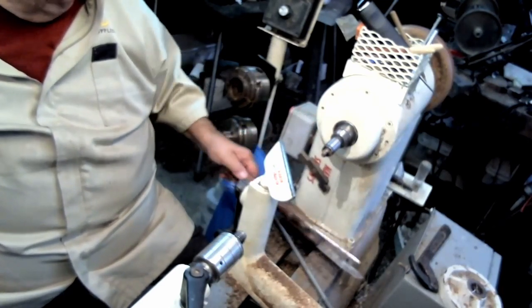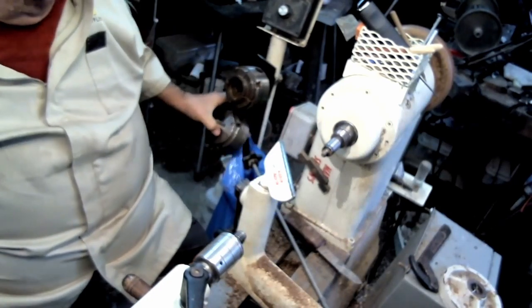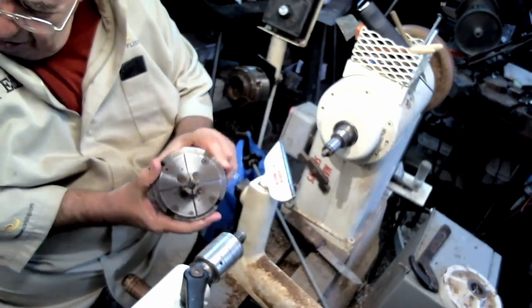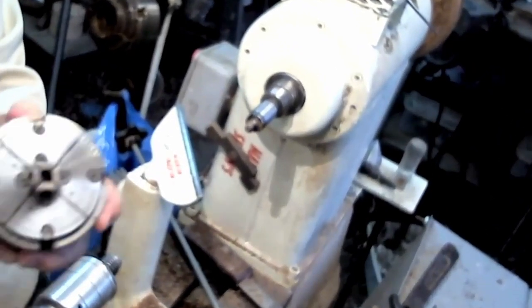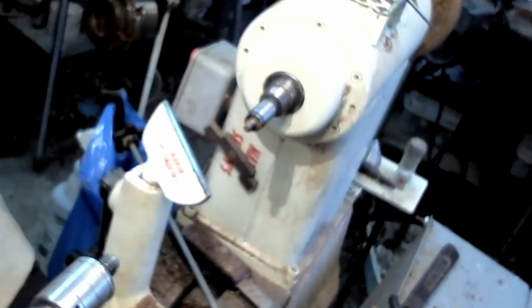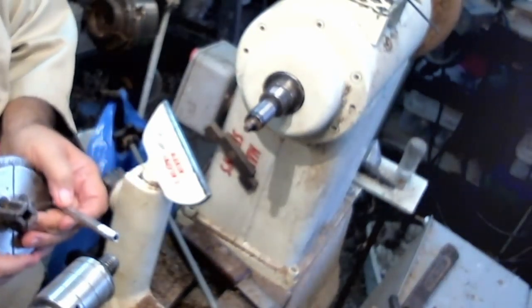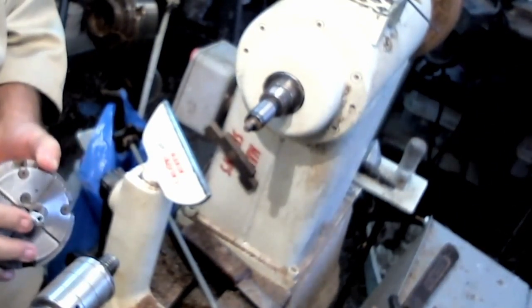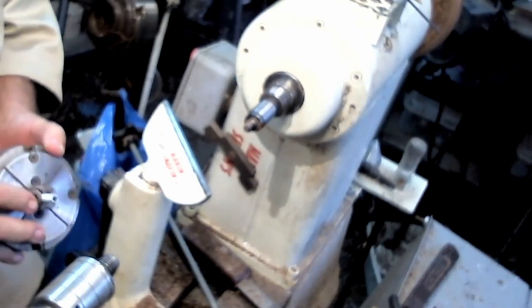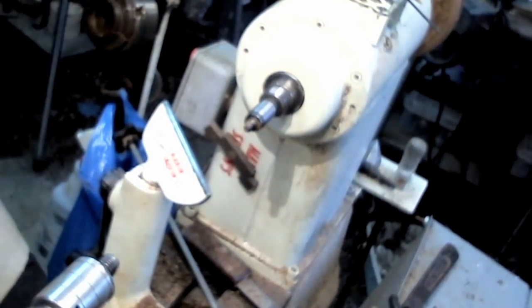I'm going to look at where I started doing stoppers a long, long time ago. I was taking my Stronghold chuck with those dovetail jaws, and I was holding, of all things, a 3/8-inch bolt. That's right, just a bolt. Run it through the chuck and let enough stick out to where you get a good bearing. You've got the faces to bear the wood against, which is critical. I got that at a hardware store. Expensive thing, 47 cents. But that's how I used to hold it.